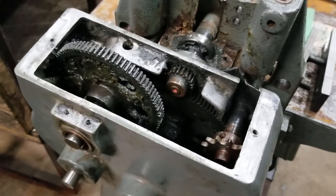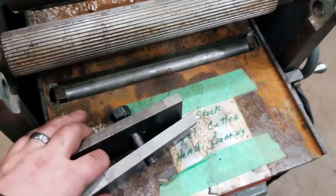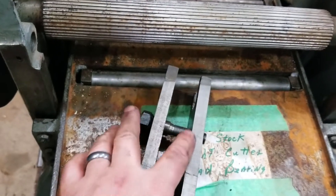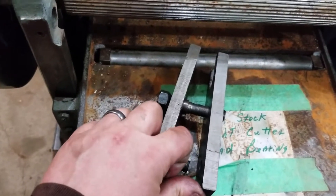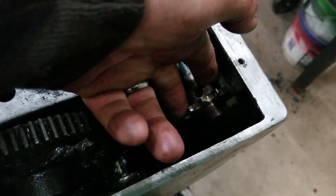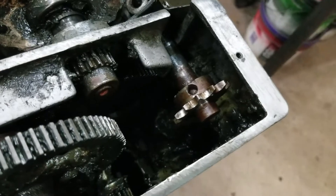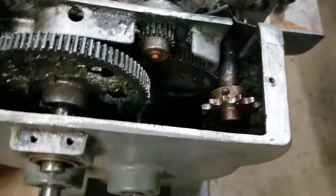What I'm going to try is this contraption I made, because I can't use a gear puller in here and I can't take the whole gearbox off and put it on my shop press. I used a half-inch plate with a three-quarter inch hole, half-inch by 20 fine-threaded bolts tied together so that tightening them squeezes the bottom together — one end sitting on the shaft and one hooking into the gear at the back — hopefully pushing it off. No idea if it's going to work; this is the last resort.